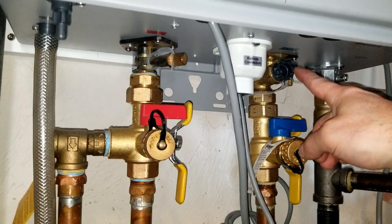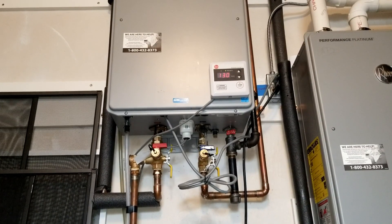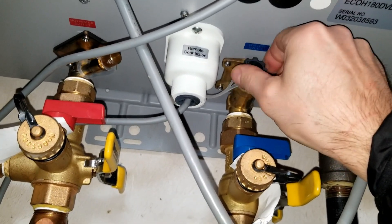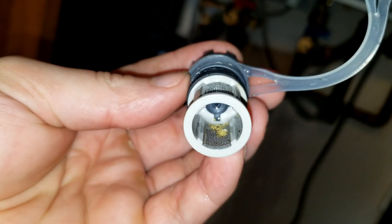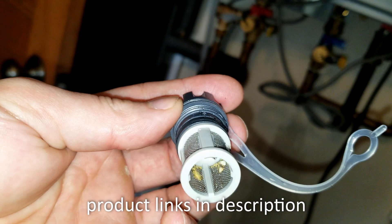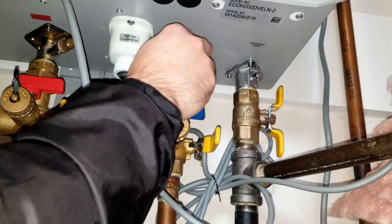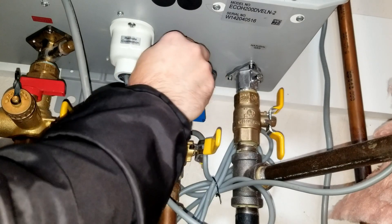To recap: you can see where the cold water filter is — it's this black little plug right there. Since I have two units, I'm going to do this again. I turned it off and I'm using channel locks or pliers to loosen it a little bit before removing it by hand, with a bucket there to catch all that water. You could also use one of the isolation valves to drain the water first. On this second unit the filter has some debris but it's not as bad as the first, and I didn't have a water flow problem on this unit. I cleaned it as best as I could, put it back the same way I took it out, turned it tight with channel locks to make sure there are no leaks.